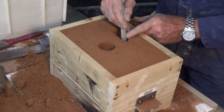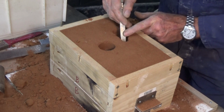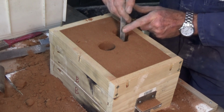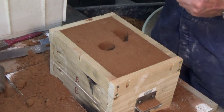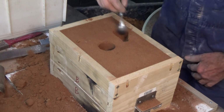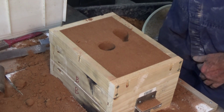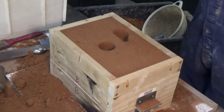Alright, so the little ridge in between the basin and the sprue needs to be no more than 10 millimeters high. It's one thing I learned from Martin. And the bottom of this basin needs to be kept fairly flat. Not a saucer shape, it should just be a sharp edged depression. Alright, so basin, sprue, riser.